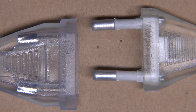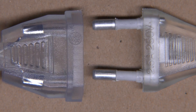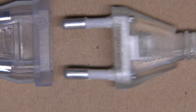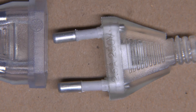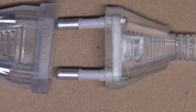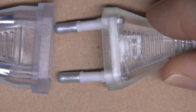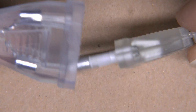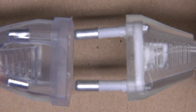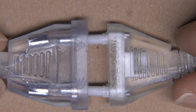Here's the plug and the socket — pretty poor quality items, wired directly onto those terminals. This plug actually does say 2.5 amps on the side, so theoretically it's only going to be good for around 500-odd watts at 230 volts. But as we'll see in a moment, if you wanted to put 500 watts through it, there's going to be a significant problem simply due to the wires themselves.